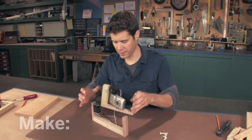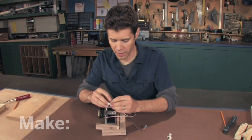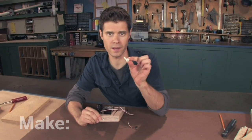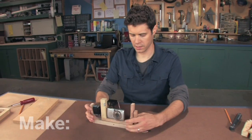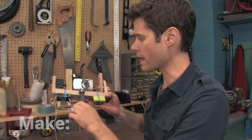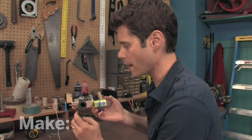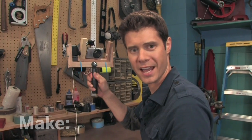I'm going to move the camera out of the way a little bit, then line up the servo arm with the servo shaft and snap these together. Now I'm going to take this nylon bolt, place it through the inner frame, put a little spacer between the two frames, and set that bolt through the outer frame. Then screw on this wing nut — not too tight because you've got to make sure it'll turn. I'll place the camera straight. The last piece of hardware is this bracket from a brush holder, which I'll use to thread onto the pole. This is the receiver that's going to receive a signal from my transmitter, and I've got the servos plugged into that as well as a battery pack — attached with cable ties to the frame. You may have to play around a little bit with the channels the servos are plugged into so that you know which joystick controls which action. This antenna wire can just hang down.